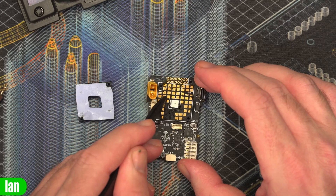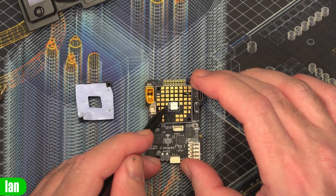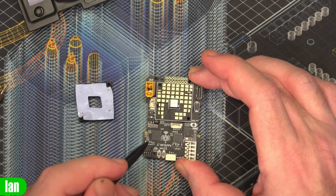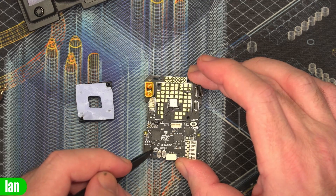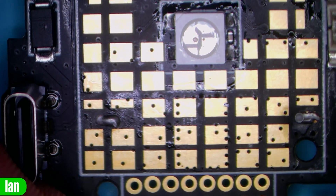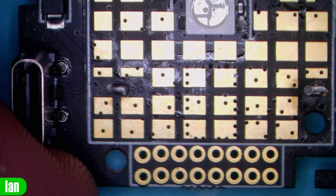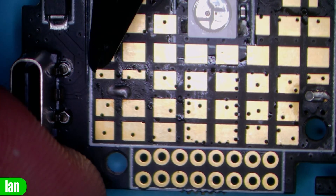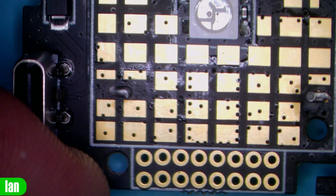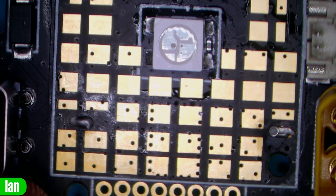You can see that there are vias on some of the little copper squares but not all of them, and they're located around the tracks on the PCB. It's an interesting setup but it's doing a good job — I've been testing this module for quite some time and I have no concerns with the temperature buildup at all. Under the microscope you can see the copper squares with vias scattered all over the board, helping to get heat out from the back of the module. You'll also notice the legs for the shielding protruding through and soldered, leaving a mark on the heatsink, but since everything is grounded it should be absolutely fine.